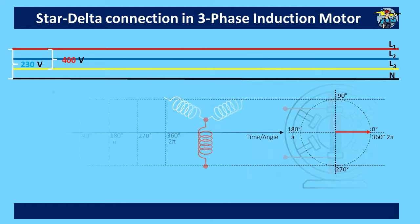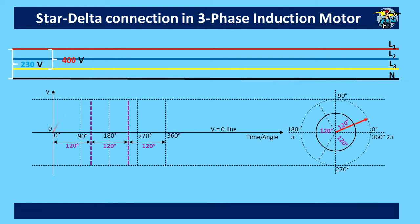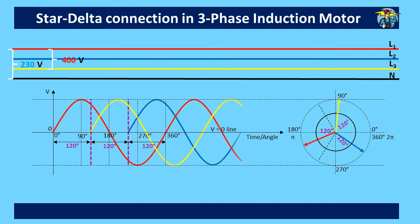Let's see how the voltage sine wave moves in a sinusoidal path. The maximum value is achieved at 90 degrees and the minimum value at 270 degrees. When considering all three voltage curves, the yellow and blue phases start 120 degrees and 240 degrees after the red line starts, with all voltages maintaining 120-degree separation. When the blue phase reaches zero voltage, the yellow line has a positive value and the red line an equal negative value, showing that the total resultant voltage is zero at any point. In a balanced load condition, the vector sum of currents flowing in these phases also becomes zero.